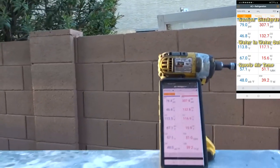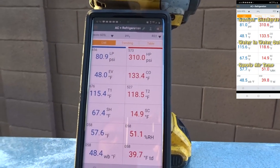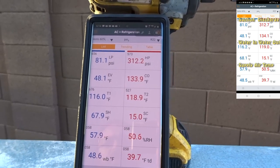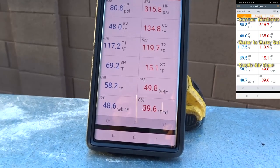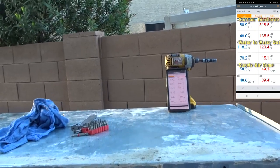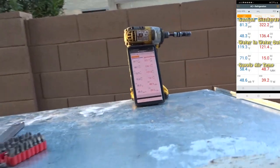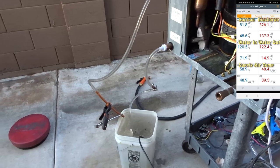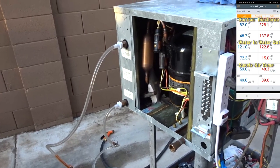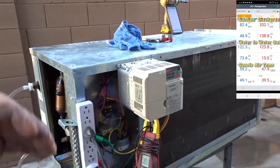Let's say I wanted to try to keep this under 300 PSI. Still a little over 300. I think right now the limits aren't letting me go below 50 hertz — that's probably about the lowest I could go right now. Water temperatures 115, 118 leaving — getting a little less temperature split there. Still got 58 degree leaving air, so it's not a 20 degree split. With the TXV, it could be actually out of throttle. I need to adjust the charge. In another phase of this adventure, I need a bigger water container to stabilize pressures and then adjust the refrigerant — pull some out, put some in — get it to a fully flooded evaporator.